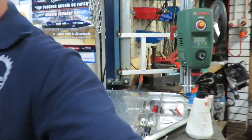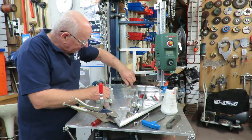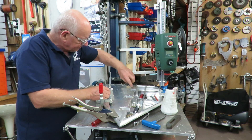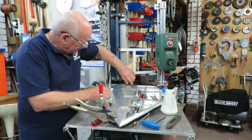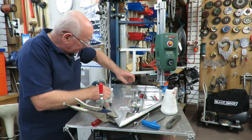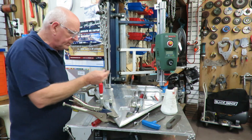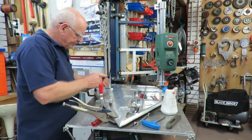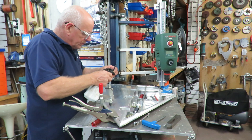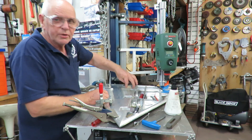I'll just move that out a bit further — otherwise I'm cutting my head off here. Run that down and pull the thread tap out, then do another run with the thread tap by hand. Because you only get a certain amount, and even though this is a spiral flute tap, it's not clearing it completely. We'll give it a blow shot, give it a bit of a squirt, and we'll go back down again and do the rest of the tapping.